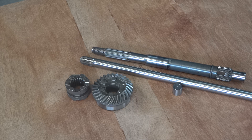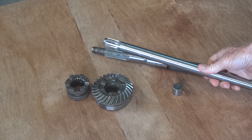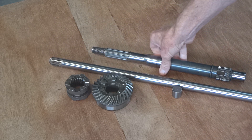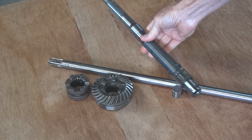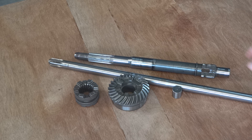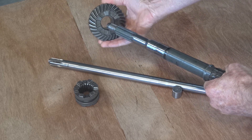Let me show you how we're going to do the bevel gear input shaft. There's our bevel gear. This piece is the original shaft that came out of the bottom of the engine, down to the gearbox in the leg, which I've chopped off — which proves it's not very hard, which is good. That is the original propeller shaft that lived down the bottom. There's our bevel gear that we're using, and that's the original dog ring. It turns out I can use it all — it works out really well.